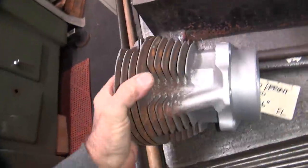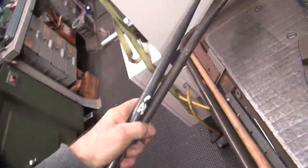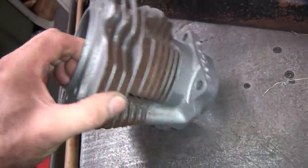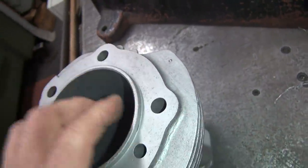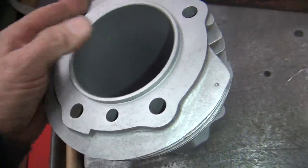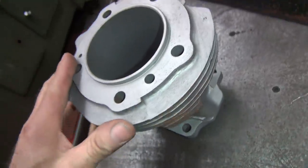So this is what the cylinder looks like after you blast it a little bit. Now if you go back and look at the hour meter from before, you can see how long it took — I didn't pay attention, you'll have to check yourself. There are the aftereffects of blasting. You can see the difference between blasted and non-blasted areas, and you can see how deep the rust pitting is. The rust will come out of the pores overnight. But overall it's about what I suspected — still smooth on the surface, not all eaten out real bad. Basically it just gives the gasket more bite on the surface now.